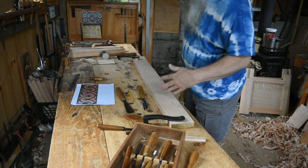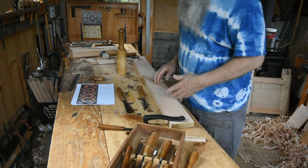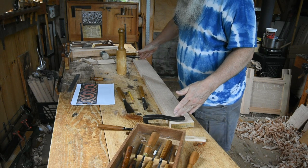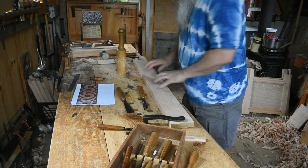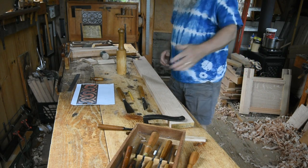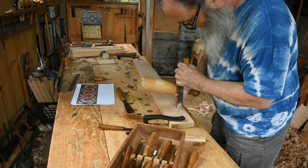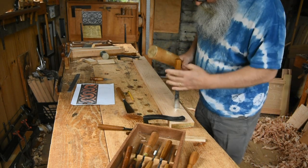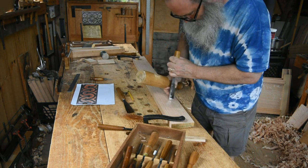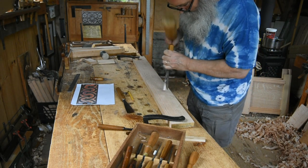One thing I want to show you very briefly is the way I'm carving for a video or for still photographs is not how I carve. When I'm confronted with a 3-foot long section like this with a repeat of one pattern, I don't carve this chunk and then move over and carve that chunk. I carve the whole row. So I'd make this cut here at my bottom left, and I'd strike those three cuts and move over to the next lunette and go likewise. These I've already struck, so I'd be hitting them harder than this. And then I'd come here and go bang, bang, bang.